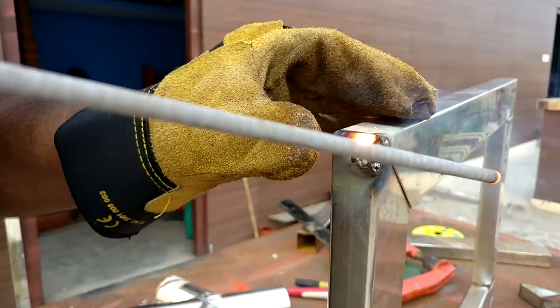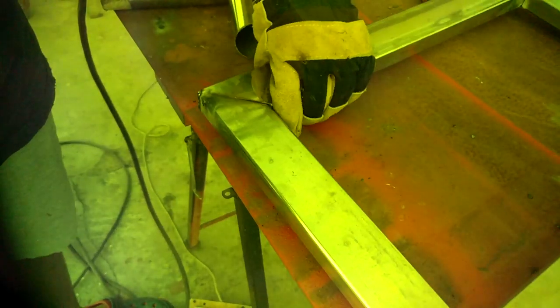Here you can see how I avoid those continuous long welds, because if I keep going for a long time it will overheat the metal surface and end up with a large blowhole. Once you start the welding joint, make sure to weld opposite joints first to avoid any kind of thermal warpage, because when the joint cools it slightly shrinks and pulls everything towards the inside.